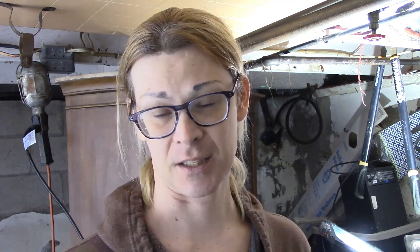Once that works, we're going to come back. Don't try this at home — I am a professional. I went to school for plumbing. I rarely set myself on fire. A couple times. Basically, I open up the faucet in the basement, just the hot water. I open up all the faucets on the first and second floors — the kitchen faucet, which is where the pipe is going to, and the shower faucet, which luckily has separate hot and cold. And the hot water faucet from the sink upstairs. That's all the hot water faucets in my house, so everything should drain down and out the sink in the basement.